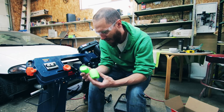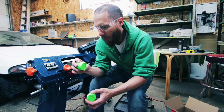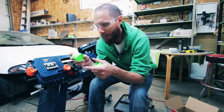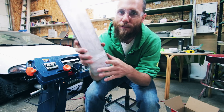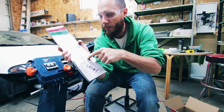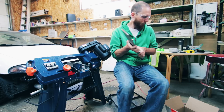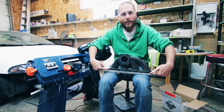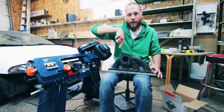I've been working on this for a couple of days off and on. The 3D printer takes about an hour and a half per two little sections, so I'm going to be 3D printing for probably the next couple of days. I need to machine out a flange out of this piece of 304 stainless that I have — I need one for the turbo and one for the actual exhaust manifold. I'll be modeling this flange surface in Fusion 360 and then putting it in the mill and milling it all out.